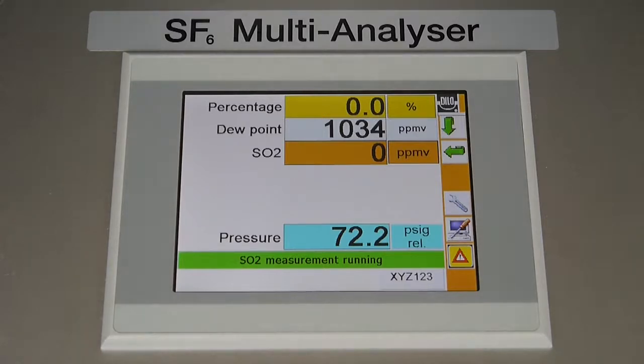The live readings screen will show you each sensor's data, the inlet pressure, and the status bar, now located on the lower portion of the screen. The dew point and pressure value can be changed by tapping on the corresponding icon. Typical test times are between 7 to 10 minutes, but are truly determined by each sensor's stability. Should a higher concentration of moisture be present, an additional test may be required to allow the sensor to equalize. When either the readings have stabilized or the test time allotment has been reached, the analyzer will complete the test cycle.